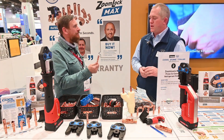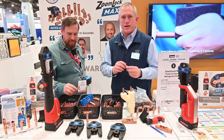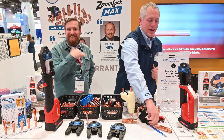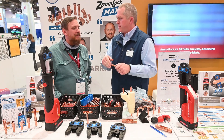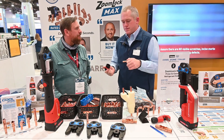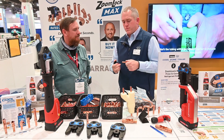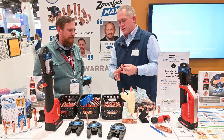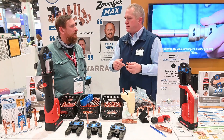So how do we make this connection? This connection is quite simple, but there are a couple of key steps to follow to make sure we get a nice, clean connection. Let's assume we cut this with a normal pipe cutter — not a hacksaw. A normal cutter does create a little burr on the inside, so you definitely want to deburr that. This is common practice for brazing as well. You take a little tool and deburr that inside edge to knock that burr off. Also, you want to take the other side and make sure that burr on the outside edge is addressed, because there's an o-ring inside this fitting and you don't want a sharp lip there that might potentially cause a cut in that fitting.